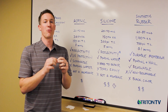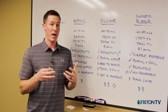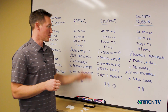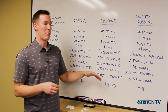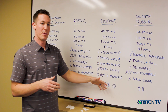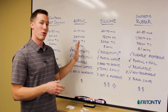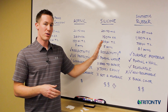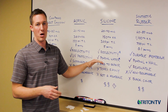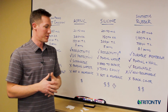The low surface energy of silicone also makes it very slippery, creating a safety hazard when dew or rain is present. It's not a true waterproofing membrane and is typically applied at only 20 to 36 mils dry. It remains an economical choice — gaining popularity over acrylic primarily because it holds up better under ponding — but you do sacrifice some reflectivity over time.